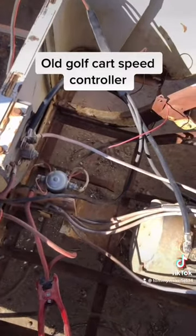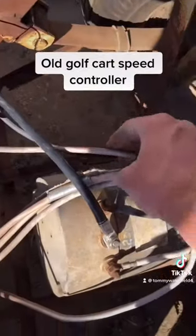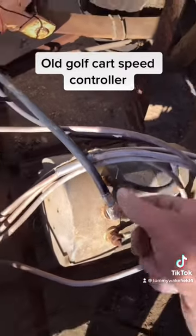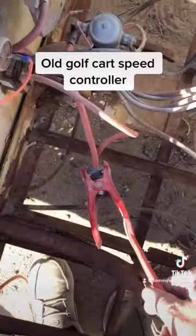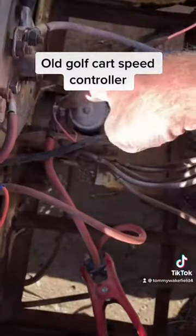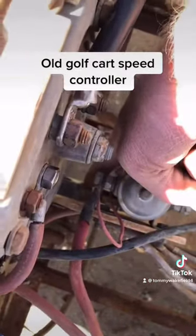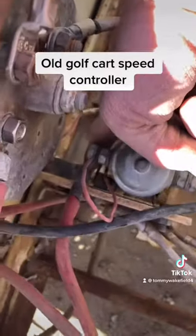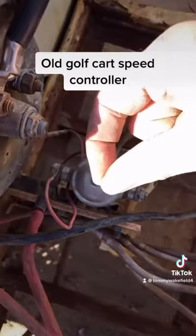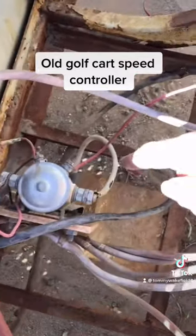Find the input — here's the negative lead, it goes on the battery and runs over and hooks right into the motor. The positive we redirect through a lot of switches and resistance. So the positive side here goes into the solenoid, and when we push the pedal this solenoid is switched on by the switch down there — a little switch that switches power on to the solenoid. It's a magnet-based switch and it turns on, and the power goes through.